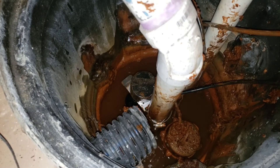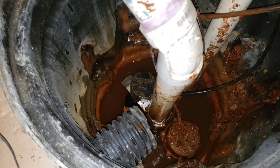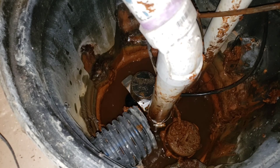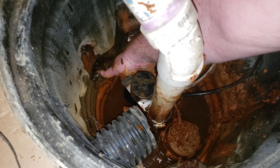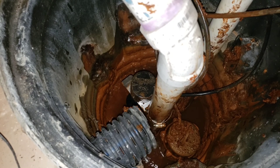They're now tight. The last step is to clean my hands, but first I'm going to plug this back in — putting the float switch plug in between my sump pump cord and the power outlet, making sure I'm right in between those and plugging in the right thing. Sump pump is now plugged in. To test it, I could sit here and wait for it to fill up, but I can also just grab the bottom of the float and lift it — and there we go, that's what we're looking for.